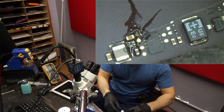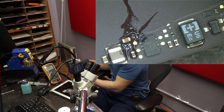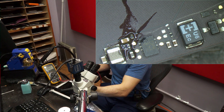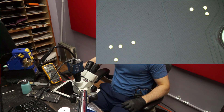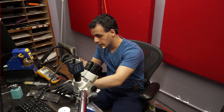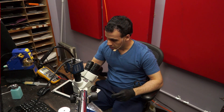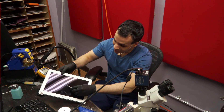The green light is coming on the board, so that's a good thing. I'm just going to show you that PP3V42 is restored. My screen just activated — and believe it or not, the light actually did come on the screen. I'm going to leave it on long enough for you to see the question mark. So this board was sent in saying no backlight, and the reason it has no backlight is because it was dead. It's dim because of the studio lighting, but you get the idea — I have a question mark there.